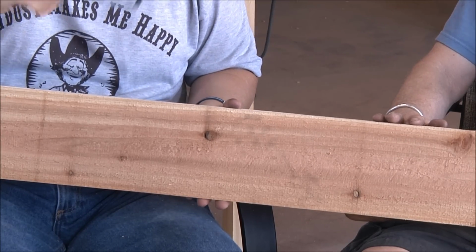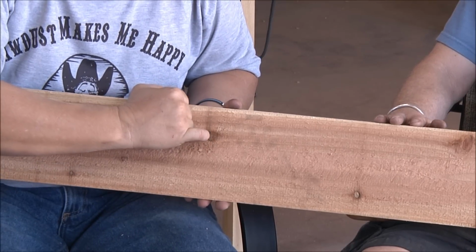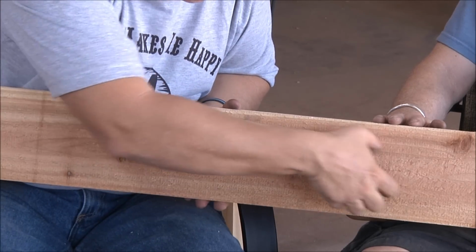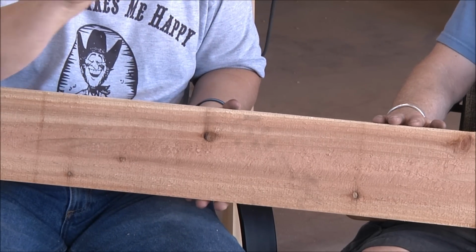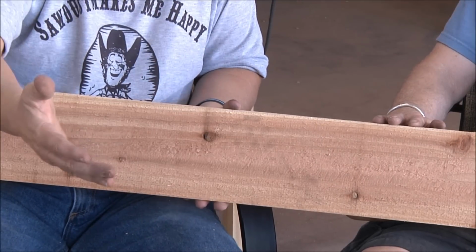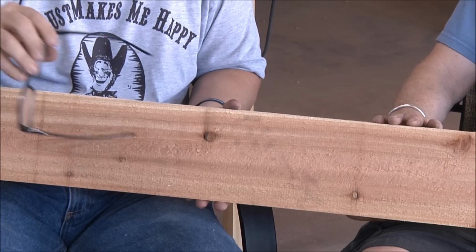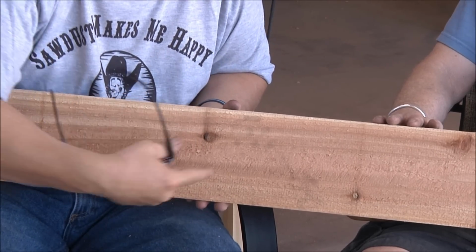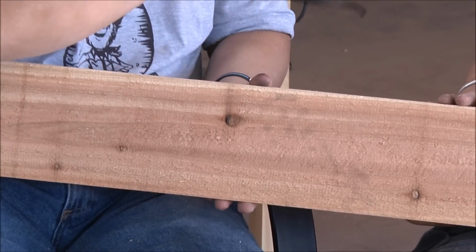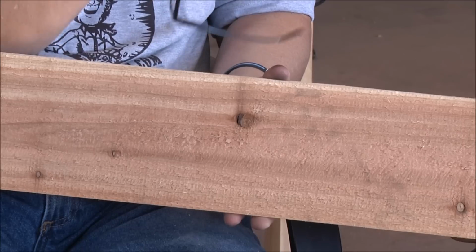There are different kinds of knots. This board has a knot where probably that little piece is going to come out. That little piece might come out. So if you can integrate a knot into a board, and my dad answered this earlier, and have it on the outside of your carving, then you're good to go. You're pretty cool, unless it's really a drop-through and kind of a loose knot. So you can integrate knots, but it really just goes back to the unpredictability of a knot.